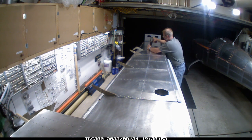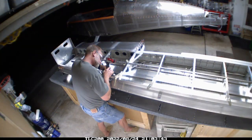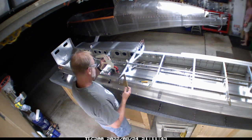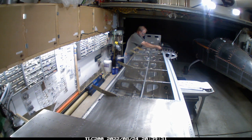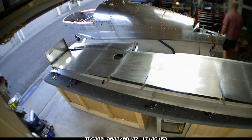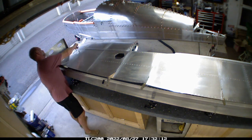I've had the part for quite a while and decided now is the time to get the wings all taken care of. I spent an evening removing a whole bunch of rivets and it went a lot quicker than I expected. On the floor plan you can see the red arrows pointing to the hinge I'm working on. Once you get it apart, you take out the rivets holding it in, put the new rivets back in, trying not to go farther than just that piece of skin — and it actually worked out really well.